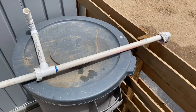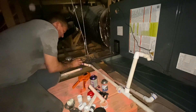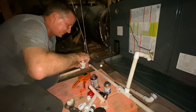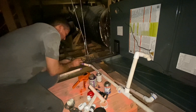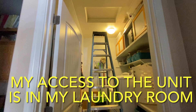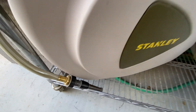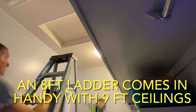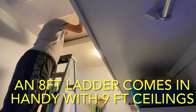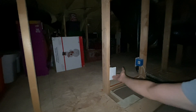The first thing I did was clear out the section of pipe I had cut off and then put that section back in place, cut the other pipe to length, and glued those two pieces back together using a three-quarter-inch slip coupler. That first section was clean because I flushed it with the garden hose out in the backyard. However I still had to figure out how to unclog the rest of that pipe going to the outside of the house. The way I cleared it was using our 65-foot Stanley hose reel, running that hose through my house. I turned it on and made sure my nozzle was well sealed and the hose had no leaks before doing this, then disconnected that primary drain at the union and stuck the garden hose nozzle in there so I could shut it on and off.